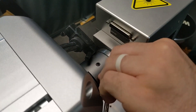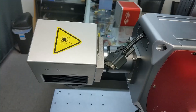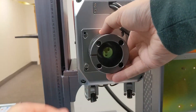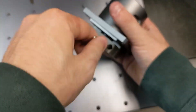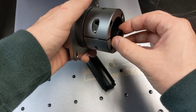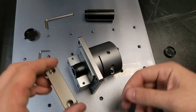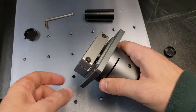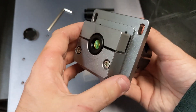We're going to disconnect the Galvo head — we just disconnected the serial cable. Now we're loosening the screw on the neck so we can slide the Galvo head out — it just pops right out. We also need to remove the neck because this is where the beam expander is housed, so make sure you pull the neck off the mounts as well. You can see the beam expander in there. We loosen the housing for the beam expander and push it through to get it out — don't try to pull it out the other way. Push it through and pull it out the front. Pop the new one in the same way with the threads towards the back. Make sure it's flush with the casing as you screw the casing back down. Tighten the screws evenly so everything stays centered. Our beam expander has been swapped — we're now going from a 3x to a 6x beam expander.